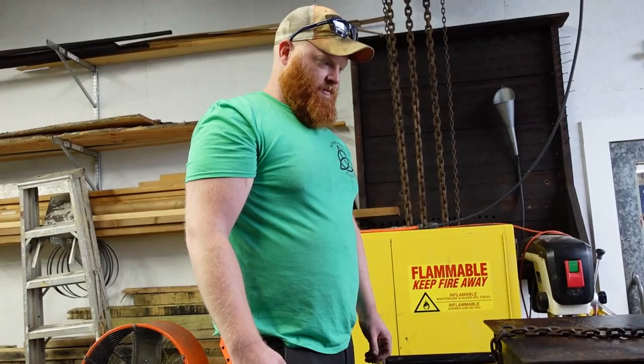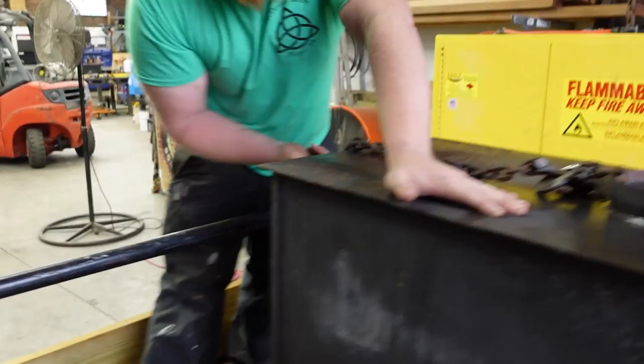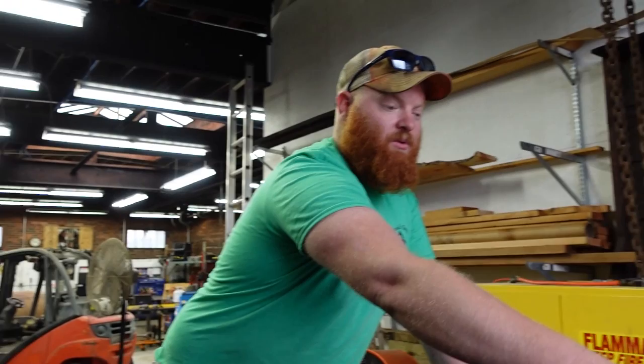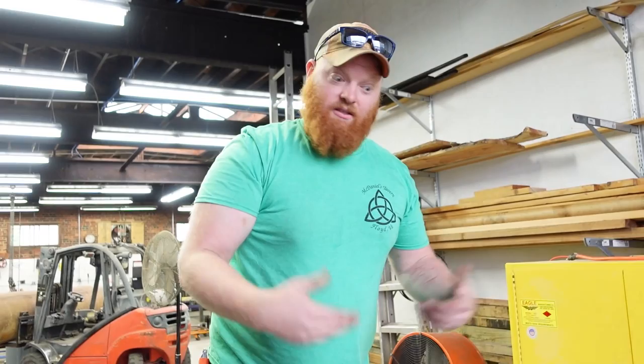I guess you better get it done before winter, huh? Yep. Winter is coming. No, I don't think this one will be too long. So really I have to slice off this whole top right here. That's the biggest section. Then I'm gonna put a thicker piece of material that I've got, some quarter inch plate right here in the trailer. Plasma cut that out and re-weld it. But while this top is off, I'm gonna do everything on the inside to make sure that I fix everything so it's easily accessed and goes quicker. Then put the top back on.